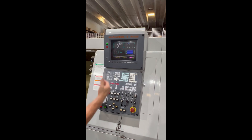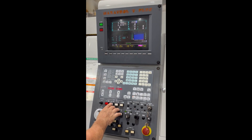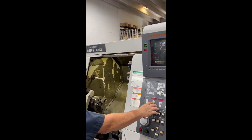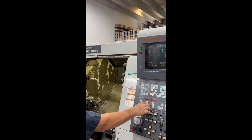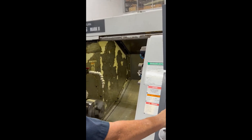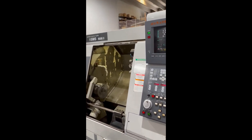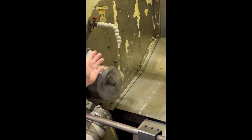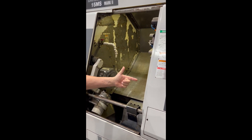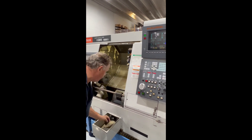The spindle — let's put it in the handle, manual. We'll set it to 10 RPM. Start. I'll go ahead and ramp it up: 30, 100, 700 RPM. Nice and quiet and smooth. Currently it has the three-jaw chuck in it. It does have the collet chuck that matches the other one that comes with the machine, and the collet tool is in the parts catcher box.